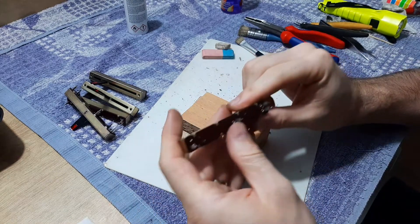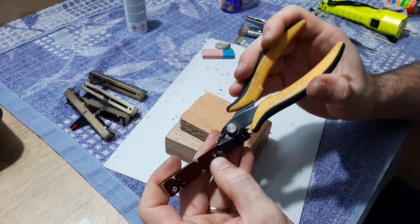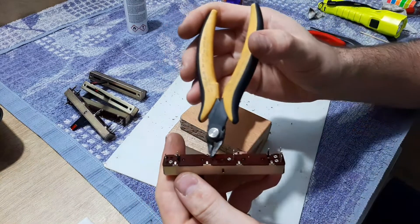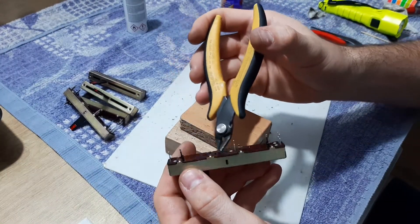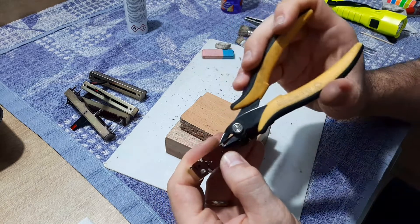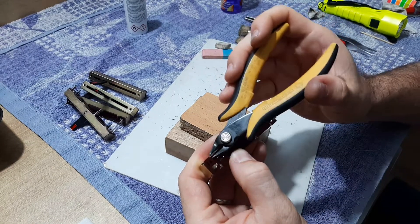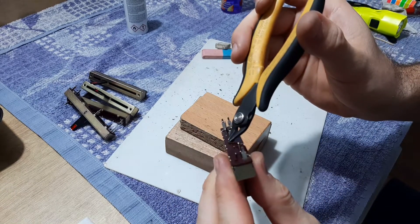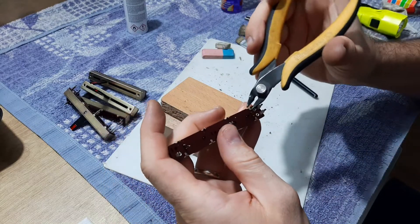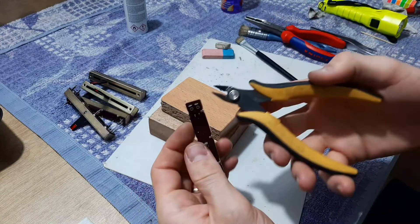You have to pay very high attention, because with this plier you can cut these small parts — edges which are keeping the resistive board support. It's kept in position by all eight of these blockers. What I'm doing is grabbing with the plier and bending them — you see, now they are perpendicular on the edge. I'm doing this with all eight. Here it's a little bit difficult but you can do it from the other side.